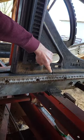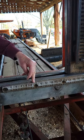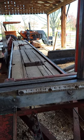We've got this pointer here. So if I point this down to 10 inches, I'll know I've got a 10-inch log left. And if I move it four inches, I'll know I've got four inches sticking out minus the kerf of the blade — three and three quarters. That's another way of figuring out how big the cants are that we are sawing.